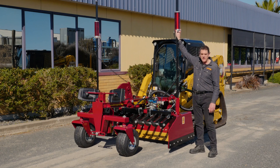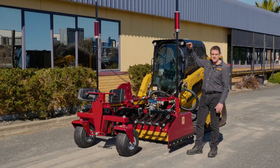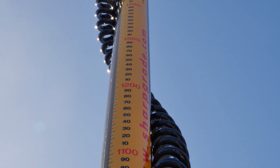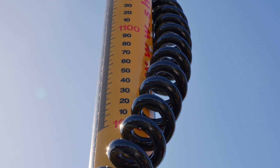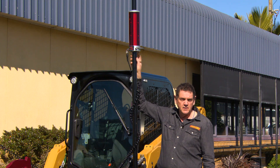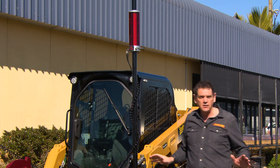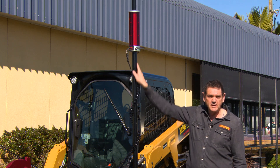We have our Quad Grade 2D lasers with adjustable grade height of plus or minus five inches — plus or minus 120 mm — standard with Quad Grade. We have graduated laser receiver poles so you can set your blade on your datum, adjust your laser receiver until it's striking the laser in the correct position, lock it, note the dimension underneath the receiver, set the other one to the same height, and start grading. There's no tape measure needed — it's all because of our graduated laser poles.